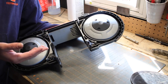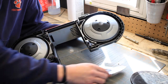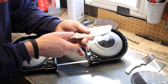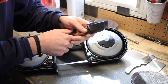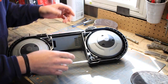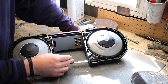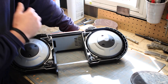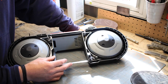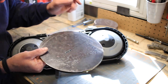The 14 TPI cuts a lot quicker, and in something like 3/16 tool steel it cuts much better than the 18. I've got five mini cleavers cut out on this as well as this blade, and that was all on one 14 TPI blade — it shows absolutely no signs of wear whatsoever. It cut the last knife just as fast as the first one, so I think that's a fairly good indication it's going to work quite well. I also used this blade to cut the slot in the plate table that I made, and I'll show you that in one second.